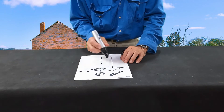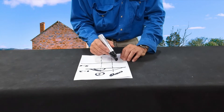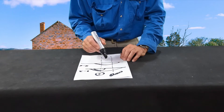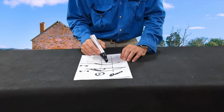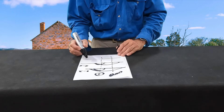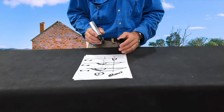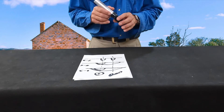If we set the recovery speed to 4 to 6, you end up getting a shorter ferrous target signal and you will start to get the $2 coin breaking through. You'll know something's there, but there will still be slightly partial masking if the targets are really close. Now, if we change our recovery speed to 7 to 8, where the screw is we will get a small, very specific target, and where the $2 coin is we'll get a very sharp one as well. You'll be able to differentiate between the two targets in the ground, but you will have less soil penetration. That's the theory behind the recovery speed in your detector.